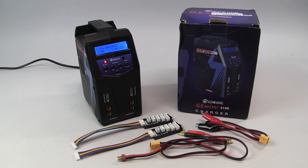So what are our final thoughts? We think this is a great charger for someone just getting into an electric setup. It's going to give them a variety of options as far as the types of batteries, and it's got the dual channels for someone needing to charge multiple packs or different types of packs at one time. It's a great option to have the AC/DC charger. The guys that have been in it for a while with more advanced setups — this might be a good backup charger or something they use on their low-end setups, but it's not going to have some of the advanced features people are looking for, like internal resistance measurement, higher wattage, higher power, and 24-volt power supply capability. So for the advanced guys who already have chargers this might not be something they're looking at, but for the guy just looking to get a good value intro charger, this might be something to consider.